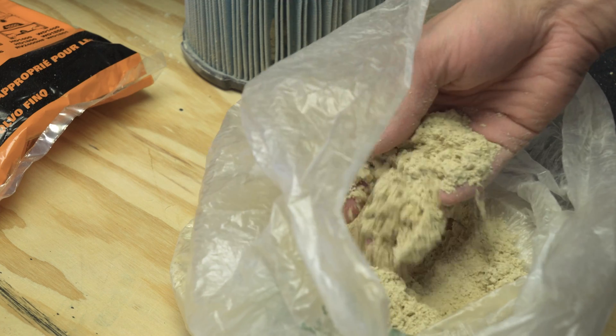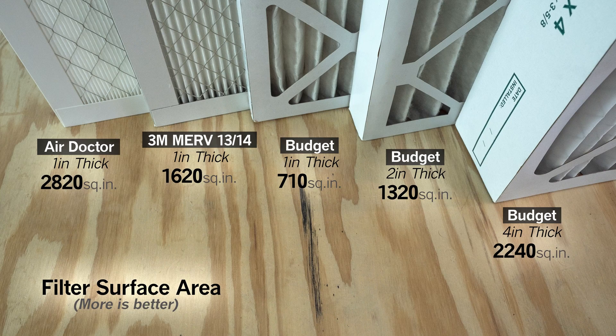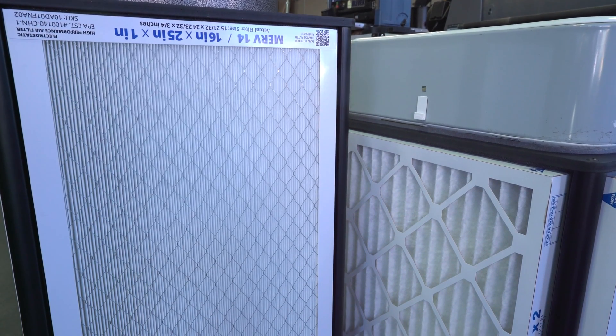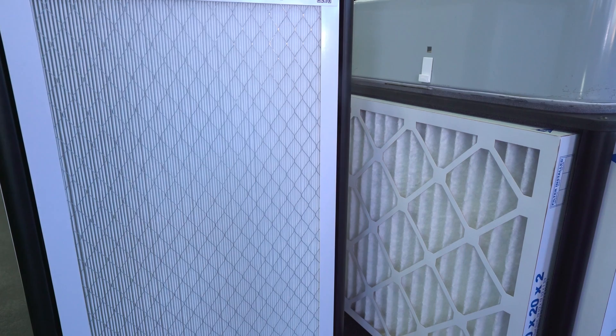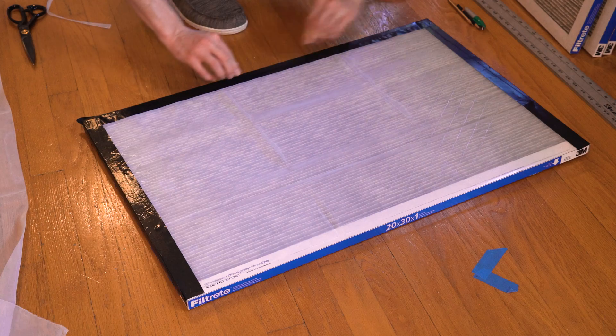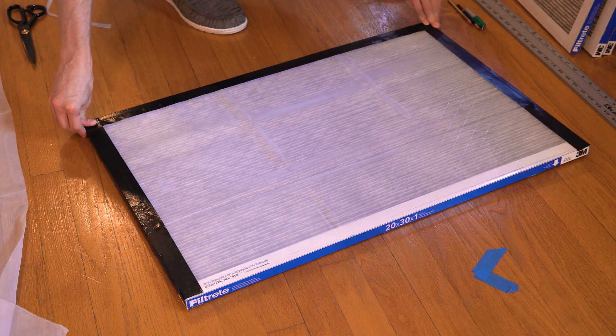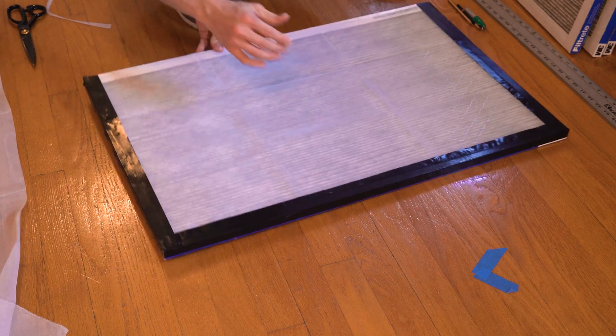If you operate this filter in your home for several years, it may never collect 1 pound of dust. I've talked about filter size, but that's not the whole picture. The main factor that determines how efficient a filter can be is the amount of material it is made from. Looking at a few of these, we can see that the 3M filter and this AirDoctor filter have significantly more pleats than the budget brands. It may come as a surprise that 2 or 4-inch thick filters don't actually provide the best performance — the best filters I have tested on quad filters are all 3M 1-inch filters. These can be fairly expensive compared to budget brands, so I will have a video out soon on how you can add pre-filters to your disposable filters so they last as long as possible.